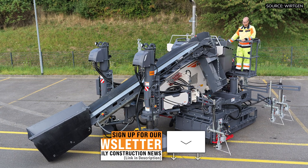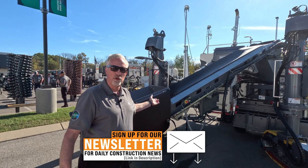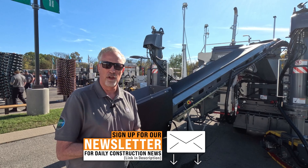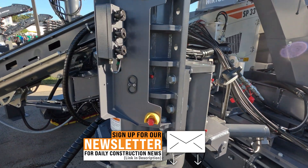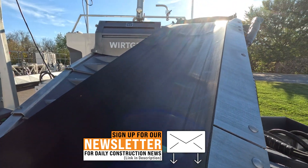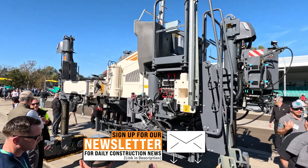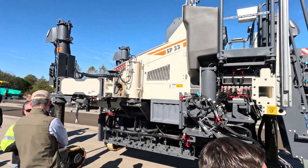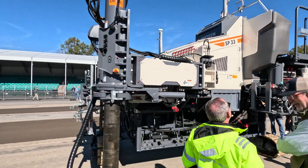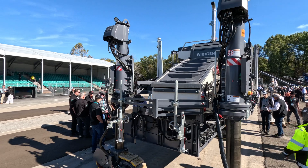A few things that we've updated here — let's start with the conveyor. We've really simplified the conveyor and shortened the height of it to give it less maintenance. We've reduced the amount of rollers in there, which is really helpful from a maintenance standpoint. We also have an improved scraper, which was one of the challenges people had with any curb and gutter machine — getting the mud into the mold. That's been a big improvement for us.